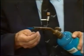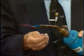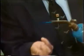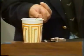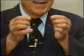I heat it up to a red heat in the flame and quench it in the water. Now if we look closely at this again — really inspect it — when I try to bend it, it just breaks in two. It's brittle.